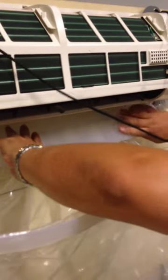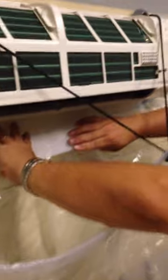What we're going to need to do here also — included in the kit are two pieces of flashing. This allows you to slide underneath the ductless unit to prevent the water, when the drain pan overflows, from dripping down the wall. You're just going to put that there. And then you're good to go.